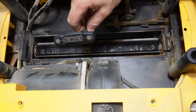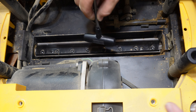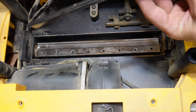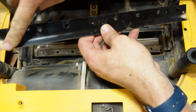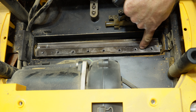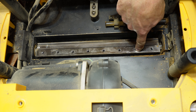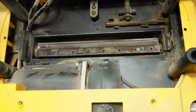Once all the screws are removed, use the tool — those two magnets are used to pick the blade bar up and remove it so that you're not getting your fingers near the blade. The cool thing that DeWalt has added to this planer is these reference points, which help you line up the planer blades perfectly without having to calibrate them.